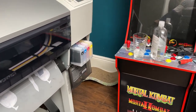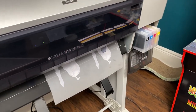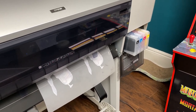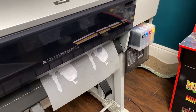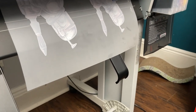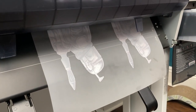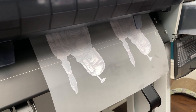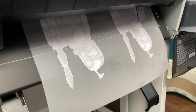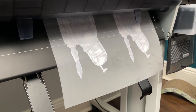You can hear the sound — that's the vacuum. The purpose of the vacuum is to keep the film stable. The white is really good, holding up really well. The printer is inclined at about 75 degrees — semi-vertical — to test whether the film holds the ink, because otherwise it would start dripping. All other printers print horizontally; this one is vertical.